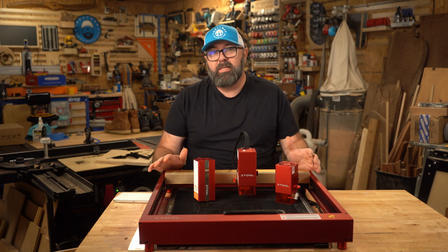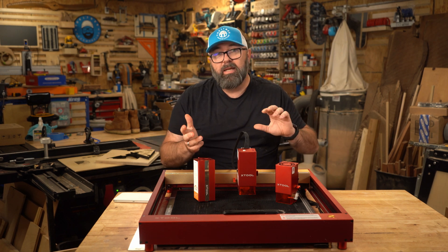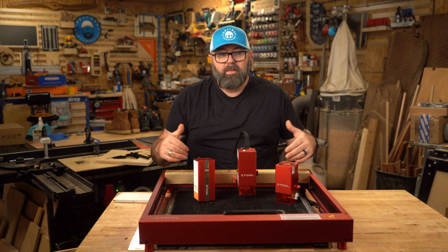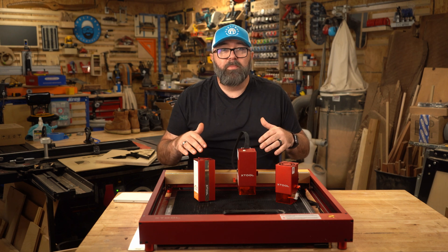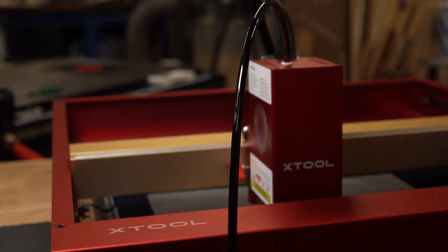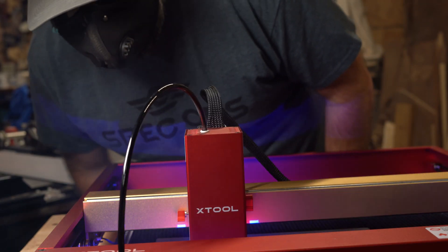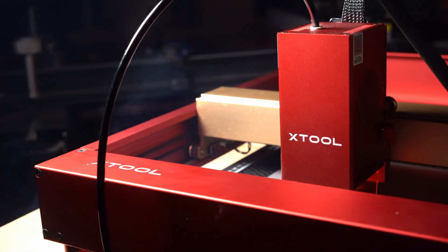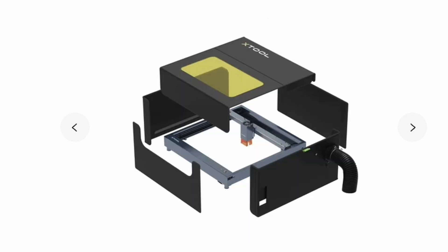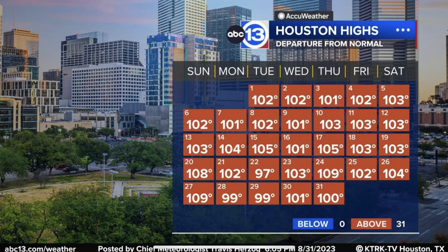Exhaust can be an issue with these types of machines. With a CO2 laser, it's typically self-contained with a vent to the outside — essentially a closed system. The diode is an open frame system, so you'll have to purchase or make your own enclosure. As you can see in this video when I was running my Xtool to cut rubber stamps, the exhaust can be pretty intense. I was wearing proper PPE and had the garage door cracked open, but I highly recommend getting some sort of enclosure to control the exhaust.